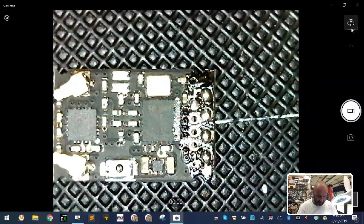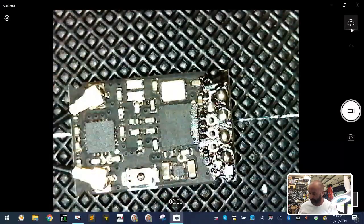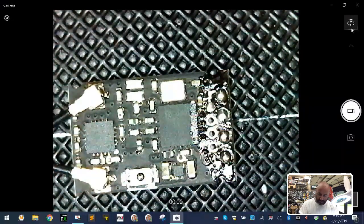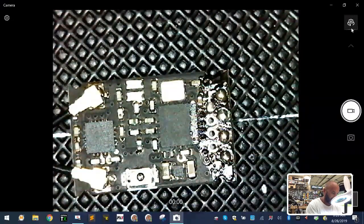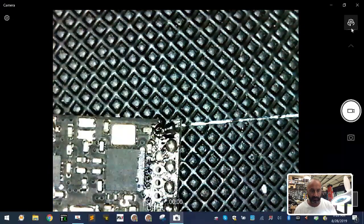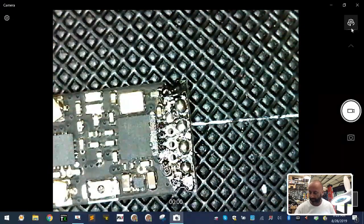I do not believe they give you any wires for this. It does not come with any wires, so I'm gonna have to now just find some wires to use with this, and I'll probably grab some old FrSky wires or something. And let me see what else they're telling me here. They are saying that port settings, okay. They said to use the F port. Use Betaflight settings, use this or F port. So let me see. USB VCP. Okay, they're saying to turn on serial RX, which we know. Telemetry output, F port, receiver mode. Okay, so let's just see how this is going to work, okay? Because I was not planning on using the F port, but, you know, we'll give it a shot with just the S port and see what happens, okay?